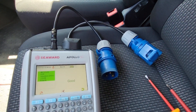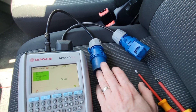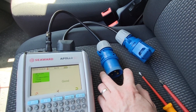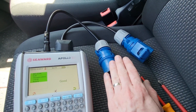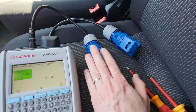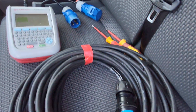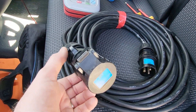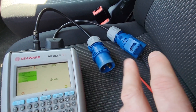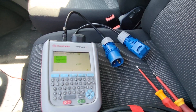And then obviously here you'll need some 16 amp adapters — I think these ones I made, but you can buy them online or make them cheaper. Just remember this is a 16 amp single-phase cable, defined by the blue connectors. Some connectors you have now are black, but three-phase power is normally defined by red connectors — but again, that's a whole other story for another day.